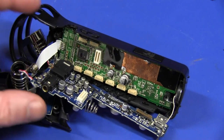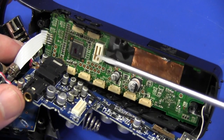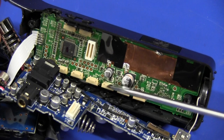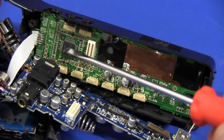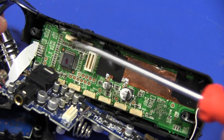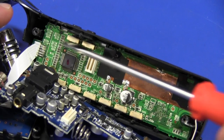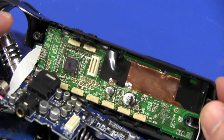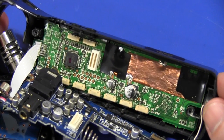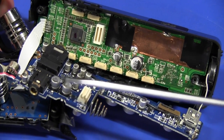Looking at the dual board construction here, I was able to lift out the microphone insert and you can see the board-to-board interconnect down here. We can see the bottom board. We can see the side switches - right-angle tactile switches directly soldered on. Some test pads - those would be for programming the microcontroller, that would be the JTAG interface. A couple more side tactile switches up here. There's the flat flex cable directly soldered onto the board. A whole bunch of resistors neatly laid out in lines - I like that when you're laying out a board, it's rather neat. And there are also electrolytic caps for the input and output coupling - the large ones would be for the output coupling for the headphones.